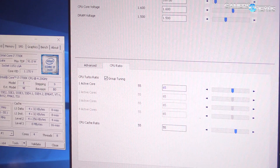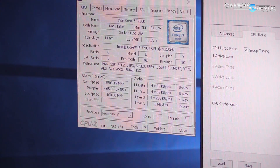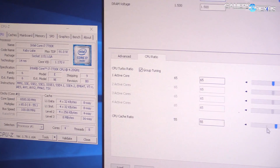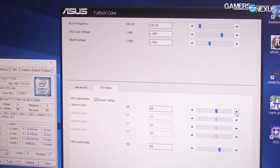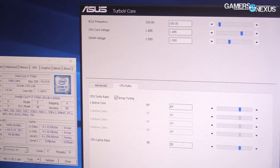We're at 65 — on CPU-Z we're reading 6500 MHz, so it's working. We're still at 1.6V vCore. From this point you also have to increase vCore — I'd say 1.88. You figure that out through trial and error. Whenever we get new CPUs we do a lot of testing to see how they react. For Skylake X we can usually only run 1.55 to 1.6V — it doesn't scale higher. But for Kaby Lake or especially Kaby Lake X, you can run really high voltages. On liquid helium we've used up to 2.2 volts — it's still fine at LN2 as long as the temperature is that low.